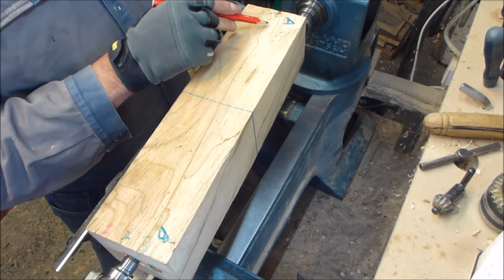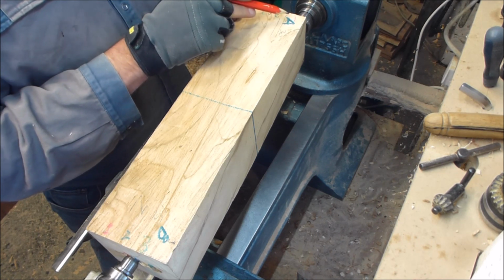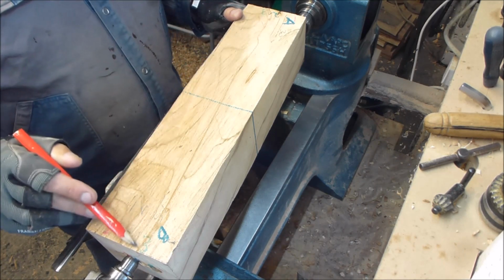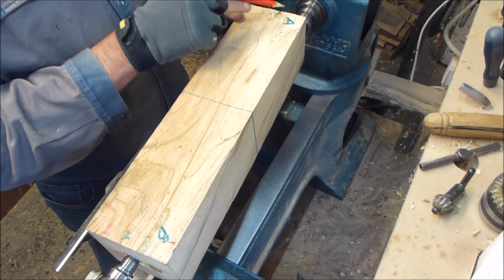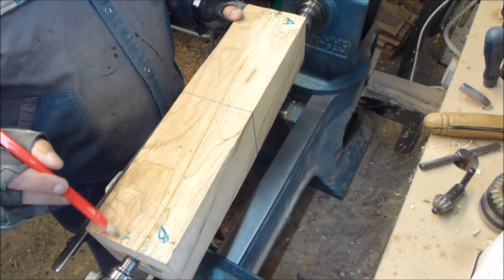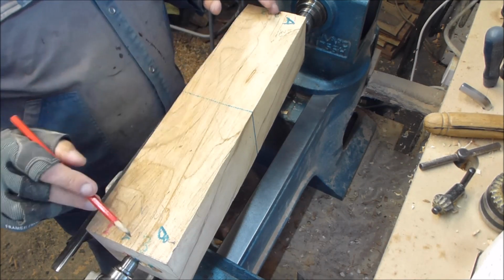This end down here is A on the left. You've got number one off the middle centre, number two 30 mil off this side, and from number two to number three is 7 mil. So from two to three on this end is 15, from two to one on this end is 30, so it's half there. And then it's half again, just about half, it's 7 mil there. And that's half of the piece again. You'll see why that's half later on. So that's just a rough idea of the measurements.